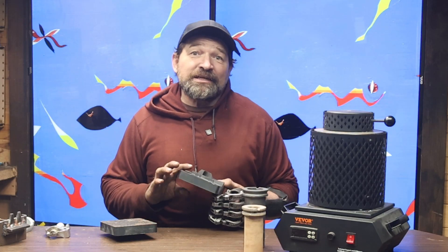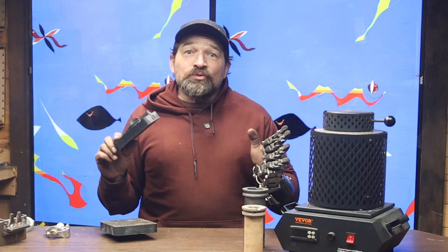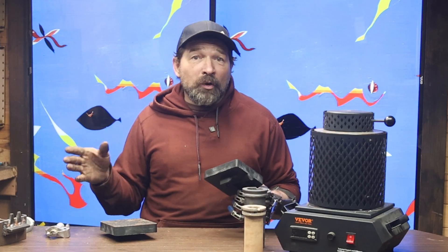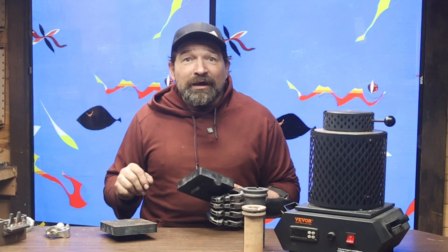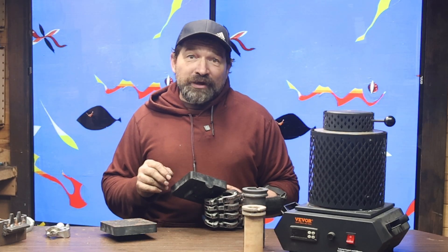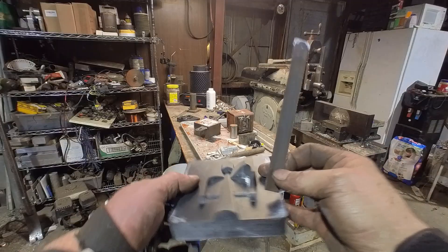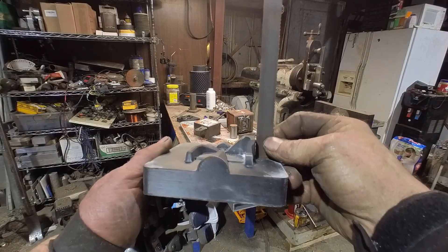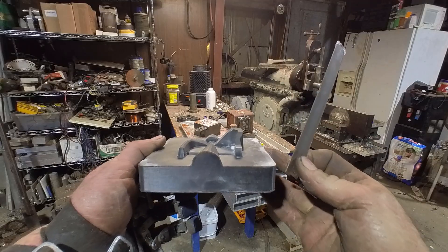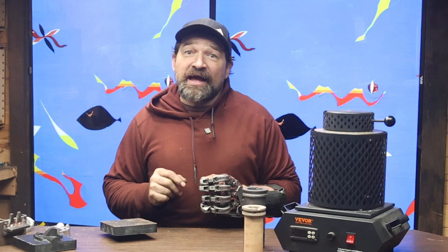This has turned out to be one of the biggest advantages that I've found by doing things this way. You never have a piece of the top mold stick to the bottom, ruining everything, causing you to knock everything out of the flask and start over again. Something that has worked really well for me with using Petrobond and 3D printed molds is designing the buck with at least four degrees of draft. This small change greatly reduced the amount of breakout and need to rework one or both halves of the mold.